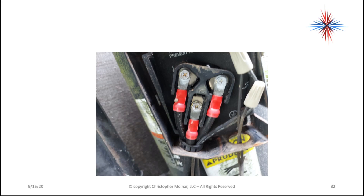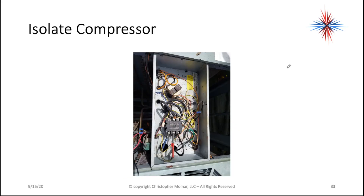Normally they're a little bit heavier duty connections because it handles a lot more amperage. Isolate the compressor. In this case, we took the three wires going to the compressor off of the contactor. You don't want it connected to anything else when you're doing these checks.